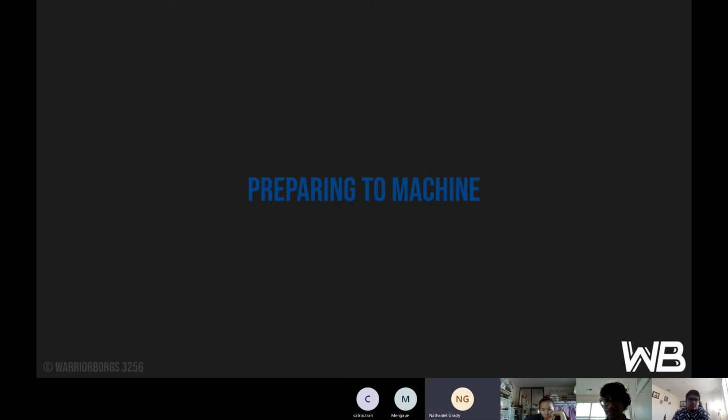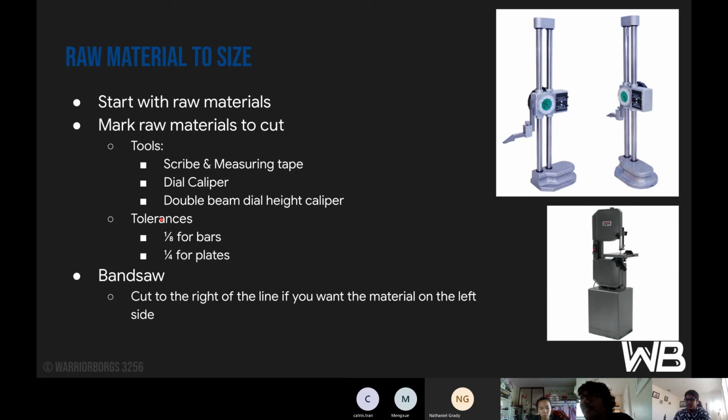What are our usual tolerances when we're fabbing a part? It varies sometimes depending on the part, but usually it's around 0.005 inches. It can be a bit more, a bit less, depending on what the part is. You said 0.005, so that's 5 mils, I think. Roughly, yeah. Okay, that's not too bad, but we should double check if there's a manufacturing calibration date or anything like that. Maybe not important for what we're doing here, but important for future fabrication knowledge. Yeah, we can check that. Definitely.